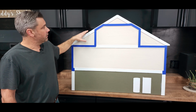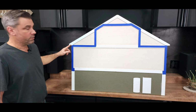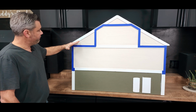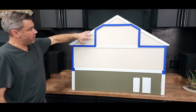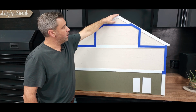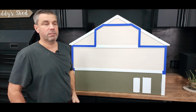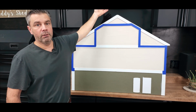So what we would normally do, let's say somebody had a baffled and fiberglass slope here. We would open up the soffits. We would place a baffle over the top of your insulation, which also is over the top of the top plate of the exterior wall. That baffle is allowing air to travel on the back side of it, entering into the space. Once you have air travel in, it's going to come through on the back side of your fiberglass and baffle here to the upper, in which case we would normally look at a ridge vent on the upper in that case. Or possibly a bunch of roof vents, maybe 4 roof vents down the building, right down there to release the heat. So you have air in, air up, and air out.